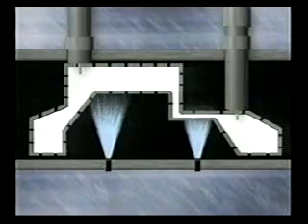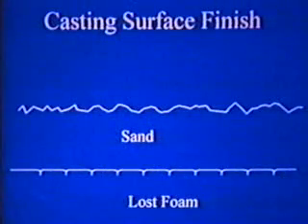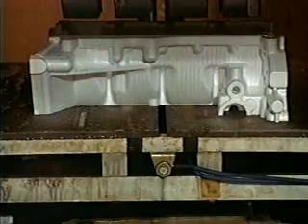Steam is again used for heat and now enters the cavity through vents and further heats the tool from the backside. This causes the beads to expand into the voids and to fuse together. The fused foam and the tool are cooled by water and vacuum to allow the foam to be removed from the tool. Tooling is typically machined polished aluminum, producing very precise dimensions and an unusual but smooth surface finish with precise detail. The tooling is exposed to only non-abrasive beads and steam temperatures and usually maintains surface finish and original dimensional accuracy throughout an extremely long life.